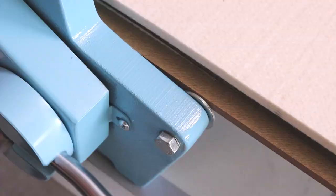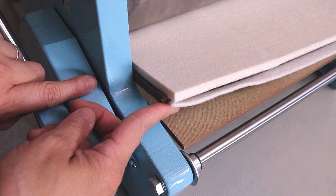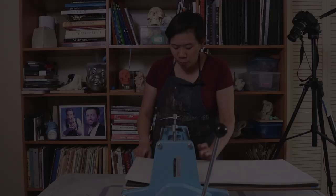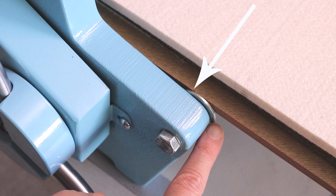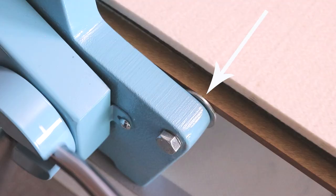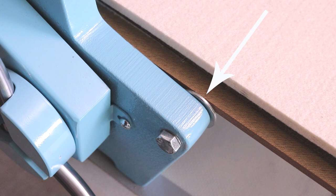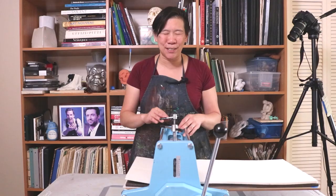Keep an eye on the blankets because if they start moving and become misaligned, you'll want to fix that — just loosen the press, take out the press bed, line them up again, and put them back. Also keep an eye on the press bed itself, because there are metallic rollers on the press, and sometimes the press bed will actually go over those circular metal pieces — you don't want that. You want the press bed edge right up against the round metallic piece. Don't tell yourself you've got it all set up and don't need to touch anything — you do need to keep an eye on these things. That's just a function of this being a small press.